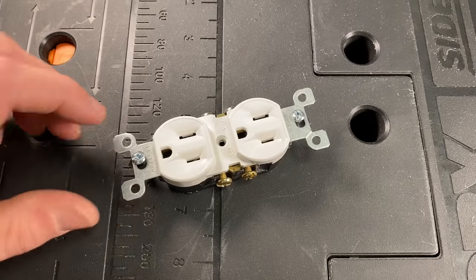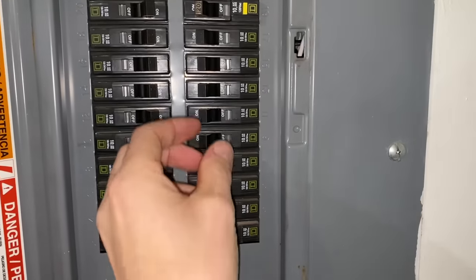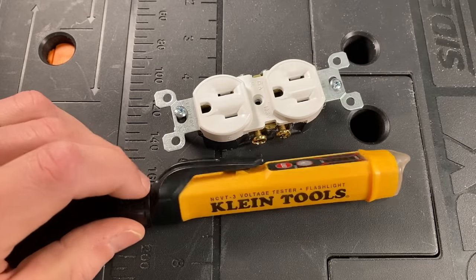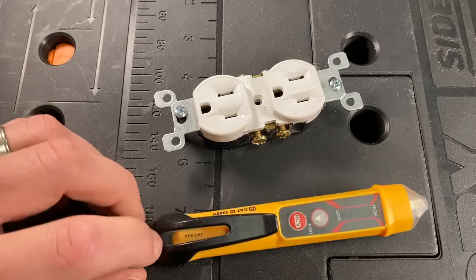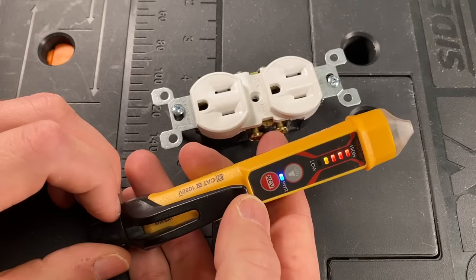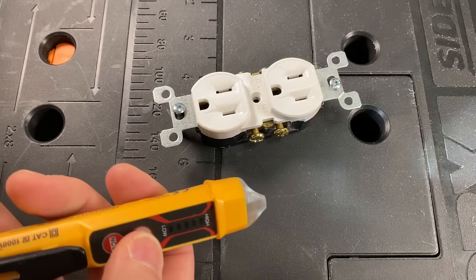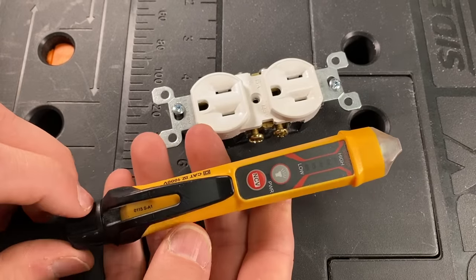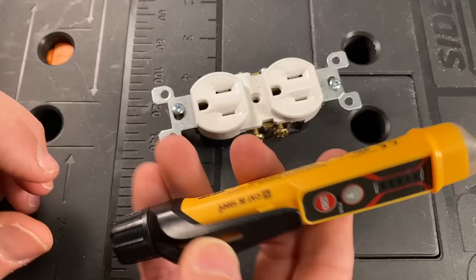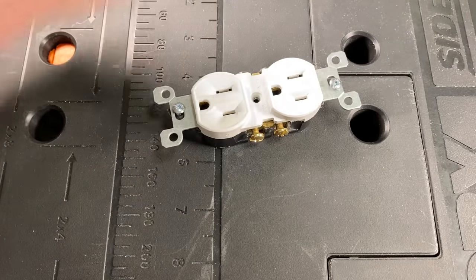First up is always safety when dealing with any sort of electrical system, and that is to make sure you're cutting power to the box by hitting your circuit breaker or pulling the fuse. The basic tool that should be in your toolbox before doing any project like this would be a voltage tester. This one's made by Klein Tools — I've had it for years, it's awesome. It has a basic detector, and this one's nice because it has a small light, which comes in pretty handy when you're cutting power and maybe cutting the lights to the area where you're working. I'll give a link in the description for this exact one, but there are many on the market that will do the job. You really need one of those before jumping in.